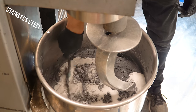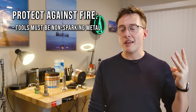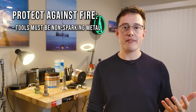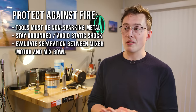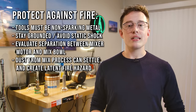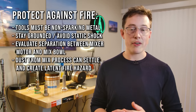For fire safety: some things are obvious — don't mix next to a scented candle — but there are non-obvious hazards. Most planetary mixer bowls are stainless steel, so any other metal you use needs to be non-sparking: aluminum, brass, or bronze are fine. You cannot risk accidentally bumping two steel or iron items together and creating a spark. Static electricity is another concern — if you're not properly grounded and touch the bowl, you can ignite AP. Electric mixer motors can also create sparks. And pouring AP or aluminum powder in too fast creates dust that settles around your shop as a fire hazard.